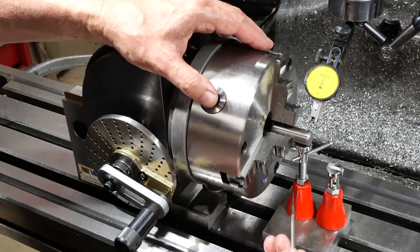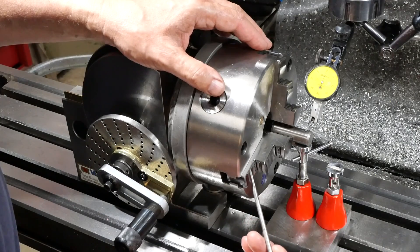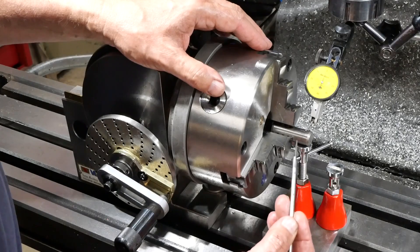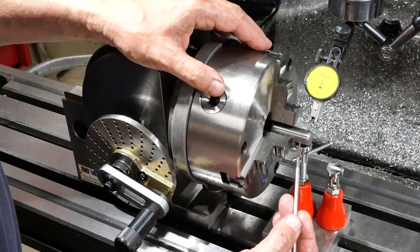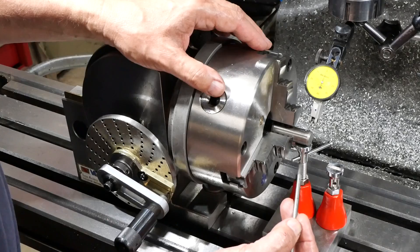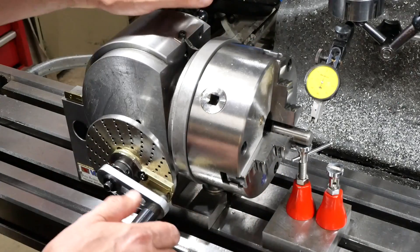So I came up with this method that's worked quite well for me. You loosen the screws off, just have them finger tight — all three of them. Put a dowel pin in the chuck, a good ground round pin. Then use a machinist jack with a V-groove to support the dowel pin, with the screws only lightly touched.